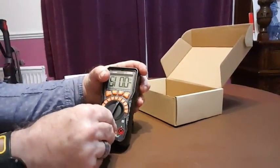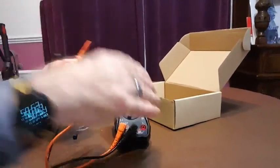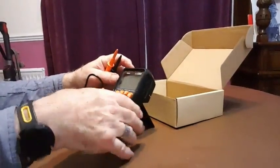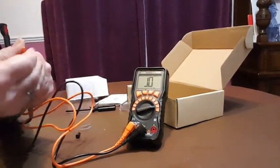In order to use it you need to pull the covers off the ends of the leads. I'm just going to do a quick test on the resistance range to make sure that it measures more or less a short circuit when you touch the two leads together. You'll notice the readings take a bit of time to settle down.